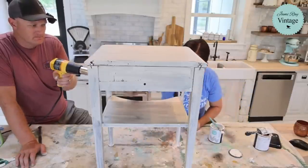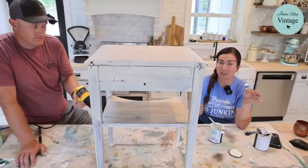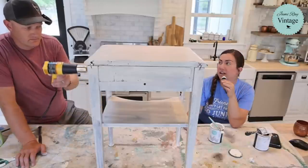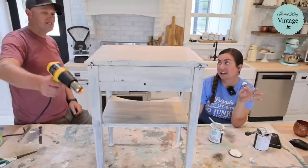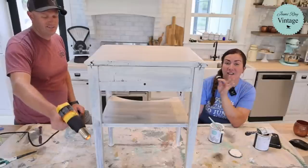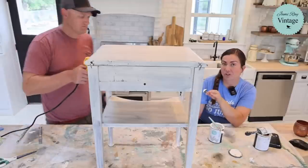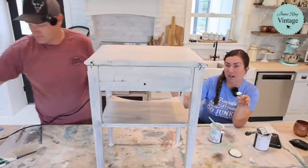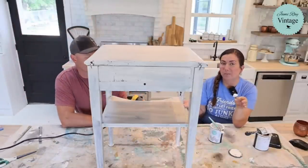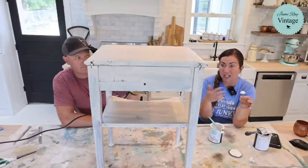Margie says she's painting her front door with paint blue. It doesn't have a UV sealer so if it's in direct sunlight, I can't guarantee it's not going to fade. The only problem I've had with it outside is when we painted two metal clamshell chairs — it rained the very next day, water puddled in the seat for a couple of days, and it peeled off where the water puddled. But everything else I've painted for outdoor use, including a milk can with a bowl on top that's in my garden, has held up really well.